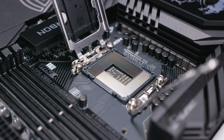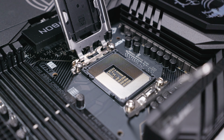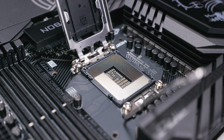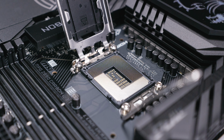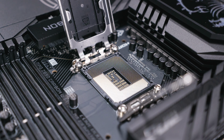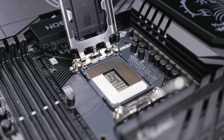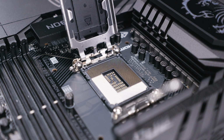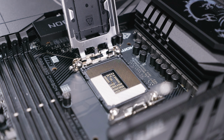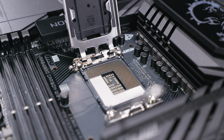And just taking a look at the socket from a bit of a different angle, you can see that it is less symmetrical. This angle shows you how different the ILM now is. It's less complicated and it sits a little bit lower to the socket, which supposedly gives better loading pressure on the socket. But as I mentioned, when we have new generations for things that we haven't seen before, we typically do a full compatibility guide and we explain the difference with the socket in depth. We can't do that just yet, but make sure you subscribe for that one there.